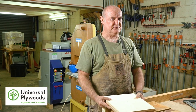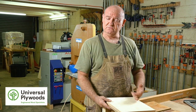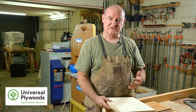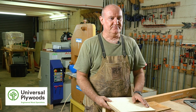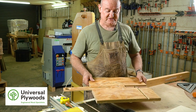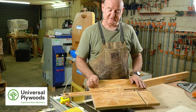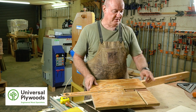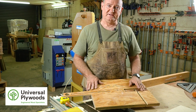How do you cut a circle in plywood? There are a couple of ways. You can use a jigsaw — it's a simple tool, not as accurate as a jig, but it will give you a close enough circle that with a little bit of sanding you can get things just perfect. I like using jigs, and I've made a jig for my bandsaw out of plywood. It's a simple one — I've got a pin that slides back and forth a certain distance from the center of the blade. I'll show you how that works. Once we've got our circle cut, we're almost home — just going to round over some edges, sand it, make it look lovely, and we've got a thing.